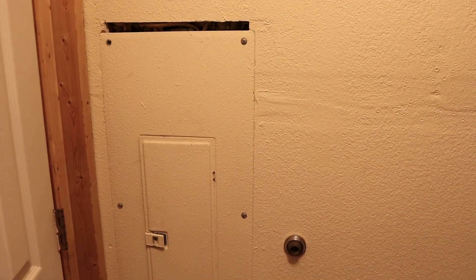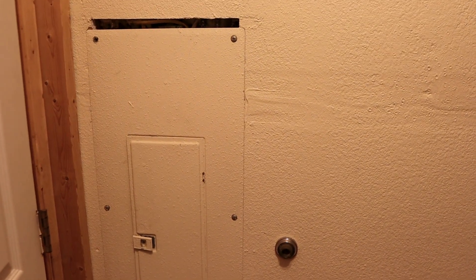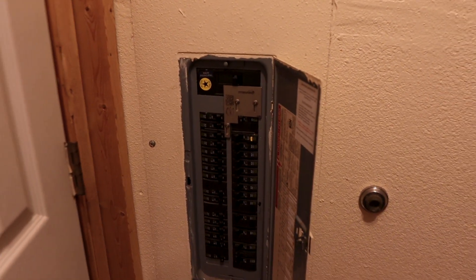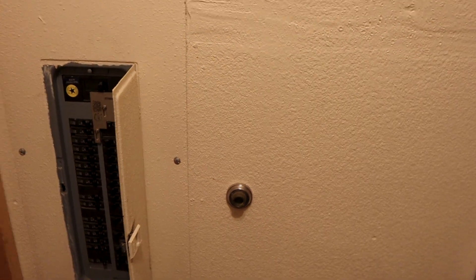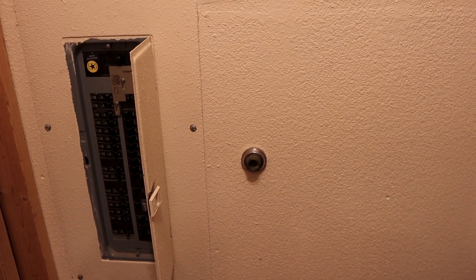Out here in their garage, the bathroom for their pool is where their main panel is for the house. They also have another meter that goes to their pool. We're going to try to install a secondary panel — basically a critical loads panel — right here next to this main panel. Their main panel is pretty full, so I'm going to put a critical loads panel over here for the 18k to run off of, then probably take some conduit back behind their water heater, basically into their sunroom through the wall. They've got some brick on the other side — we'll drill a hole through that with some conduit. That way we can have the AC power come from this panel and the critical loads panel will be right next to it, able to run the loads from the 18k.